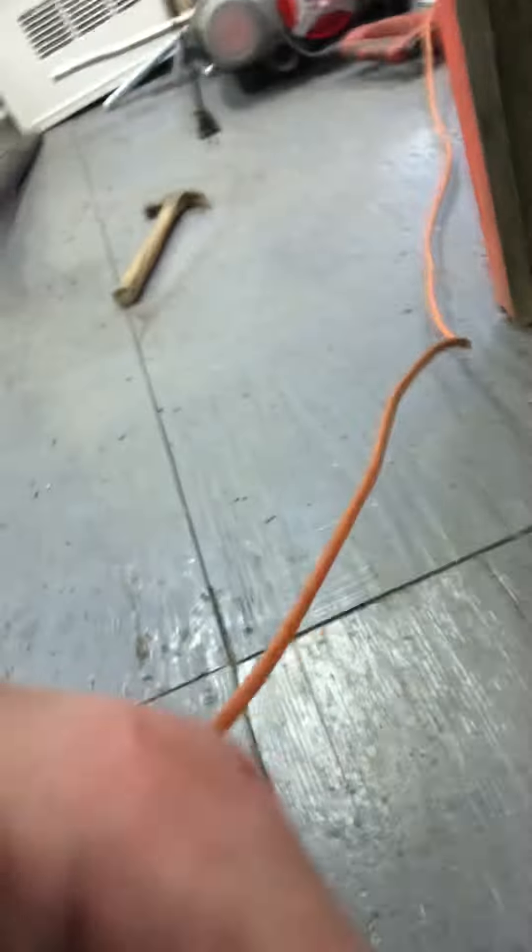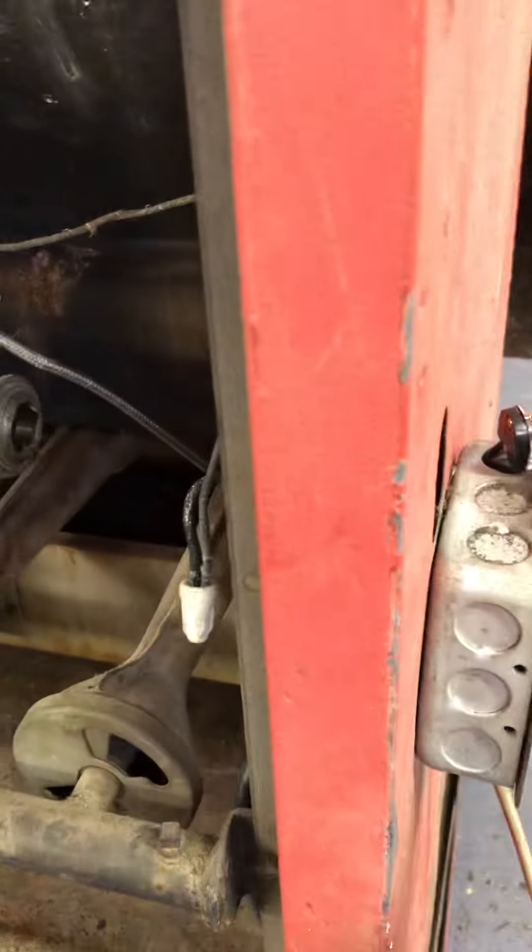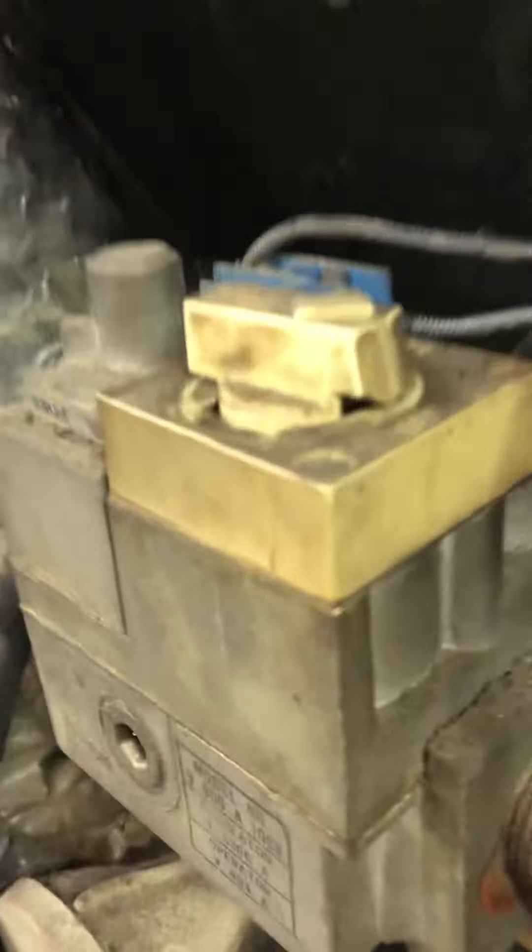Power to the motor going up and out the relay. I'll power the motor up — there's the gas valve clicking. That's working. So when I push this thermal bimetallic strip in, it should start up.